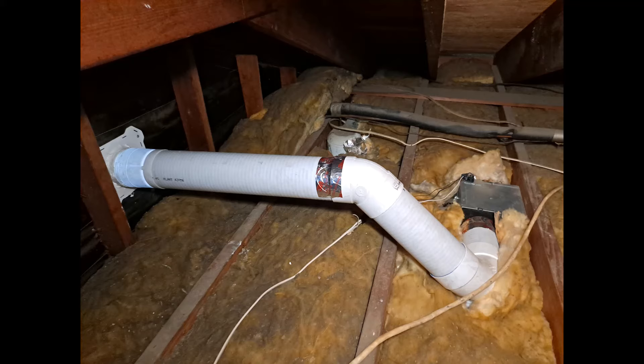Overall, I wanted to have a smooth internal surface. This is double-wall insulated pipe — I didn't want to use steel duct, but I wanted a smooth internal surface rather than the regular flexible ducting you can buy. The flexible ducting is fine, but it's going to restrict the flow a little bit, cause the fan to run a little faster, be a little noisier, and create more back pressure. Also, I felt that moisture could wind up sitting in those spiral-wound plastic ducts — so that's why I went for rigid duct.